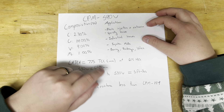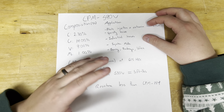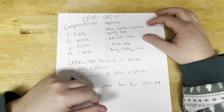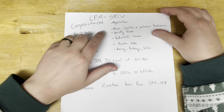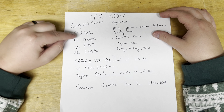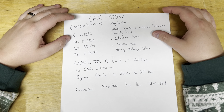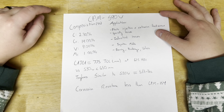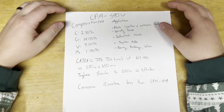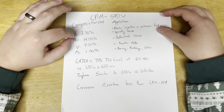is that 9% vanadium. Vanadium is one of the hardest carbides you can have in a steel, and it is an excellent carbide for extended cutting use. It's not very good for a very fine edge, but it is great for a nice long-lasting working edge. S90V used to be called 420V because of the 14% chromium — they started with the chromium amount in 420 high carbon, which is 13.5% to 14%, beefed it up with vanadium, and upped the carbon amount so it could alloy with the vanadium to create the vanadium carbide.